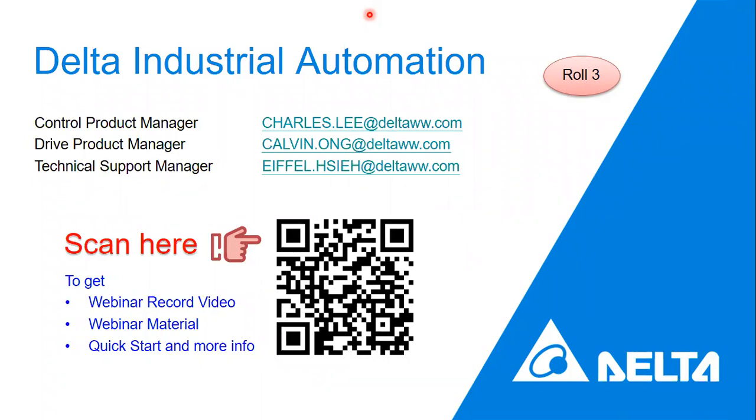Next one is, what is the advantage of using an HMI with a vision system compared to using an ordinary monitor, since it is cheaper? I think for the VGA function in the HMI, if you compare with a normal display, we don't have an advantage, because we just integrate the VGA display into the HMI. But maybe your project has a PLC, an HMI, and machine vision. In this case, the benefit is you no need to buy another display. You can use the HMI as your vision display, and switch to the HMI itself or to the display, no problem. So this is a benefit.